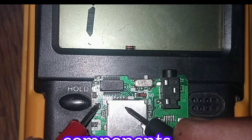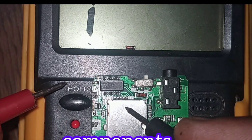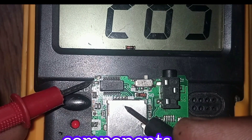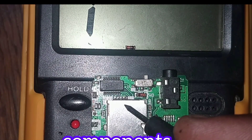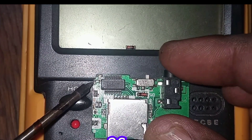These are the components — you continue to recheck. After you remove a shorted component, you have to recheck some of the other components again. Maybe you might have left one, two, or three shorted components on the board.